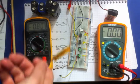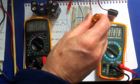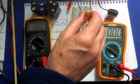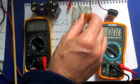So you are kind of limited because we're only using four comparators. If we had 8 comparators, then you would be able to have a resolution of 1 volt. Wouldn't be a problem. Set that back to 2 volts then, and then we'll check how good this is for checking those test cells. So let's just change that back.